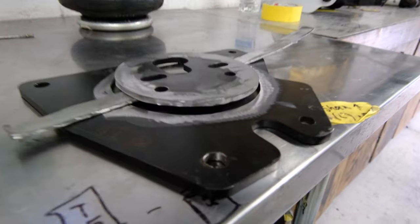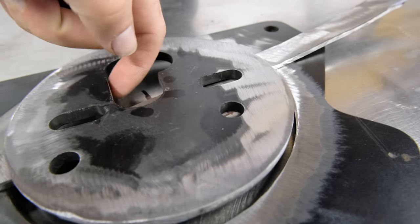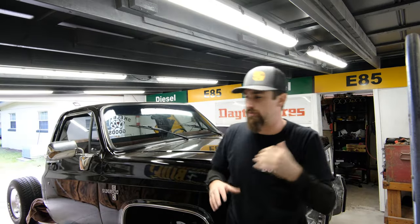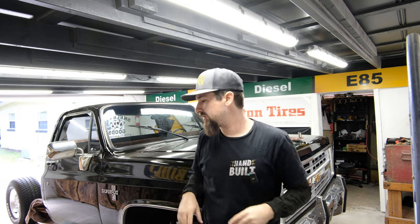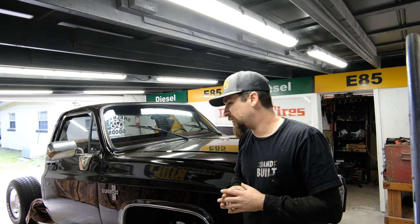As you can see, we have it all cut out and ready to go. We are going to be lifting by the distance that this right here used to sit on the table — from the table to the distance that the underside is, is how much lower we will be. I'm going to go ahead and grab my welder and put my settings on. I want to weld a little bit cooler because I'm going to walk that entire gap and build it up. On the first connection from top to bottom, I'm just going to keep walking all the way around, maybe two or three passes depending on how it looks. The main thing is we want to make sure it is nice and strong.